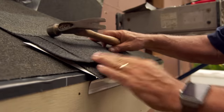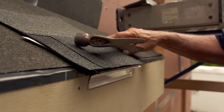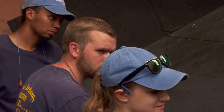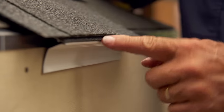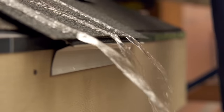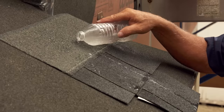I'm going to do it wrong — I'm going to place it flush with the edge. So now you can see it's all flush with the edge and the drip edge is touching the fascia board. Now, depending on wind and rain conditions, when the water runs down the roof, watch what happens as it comes to here. With driving rain, the water is going to run right off the roof. But when it starts to slow down, see what happens? See how it's sticking, going right under and hitting that drip edge right there? Getting pulled right in.